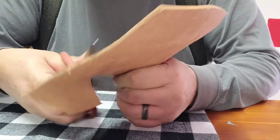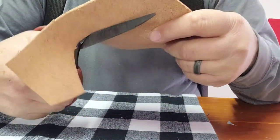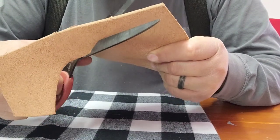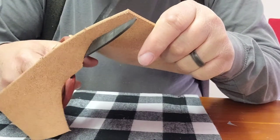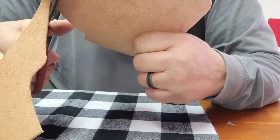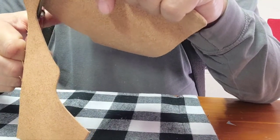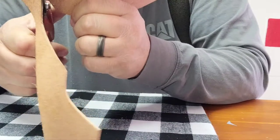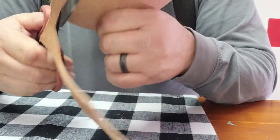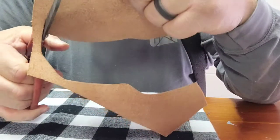I find the heavy shears work just fine. Now, if you've got really tight corners — almost like a 90-degree corner — take your leather punch and punch a hole right in that corner, then cut to that hole. That way you don't have that sharp corner that wants to tear out. If the corner is really sharp it will want to rip down. I do the same thing on steel — if I've got a really sharp corner I'll drill a hole in that corner to keep it from cracking out, because it gives a nice rounded edge on the very inside of that corner.